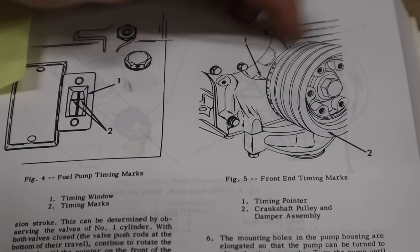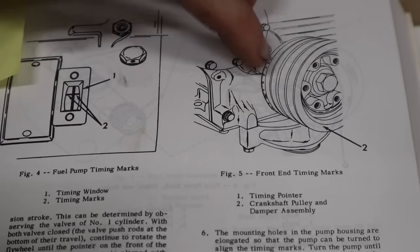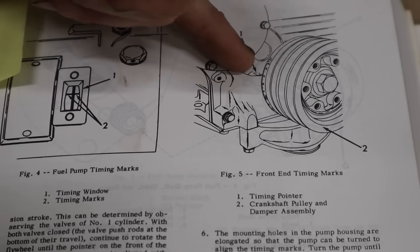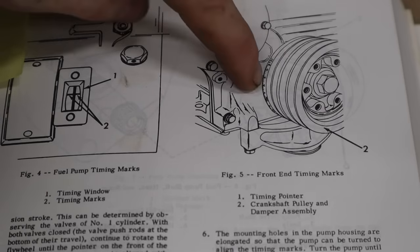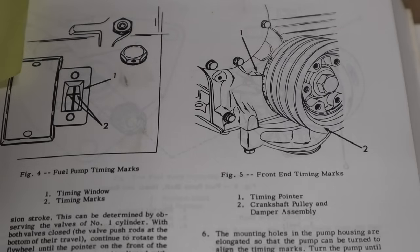So right here on this front crankshaft pulley, there are marks. And then there's an actual casting line here, the pointer, that tells you where we are on timing on the engine. So we're gonna go back, I'm gonna show you exactly where it is right now. We're gonna back it off to 34 degrees before top dead center,